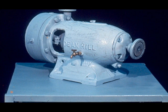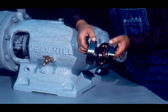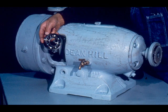This segment of our course deals with the removal of bearings from a very common type of pump now in use at many plants throughout the country. This is a single-stage centrifugal pump, very similar to many pumps at your plant. The bearings we will be removing are inside this bearing housing. There are three separate bearings: two angular contact ball bearings mounted in duplex, and one single-row radial bearing.